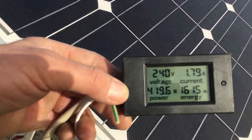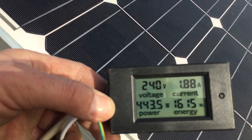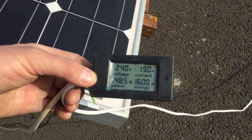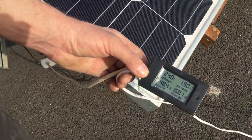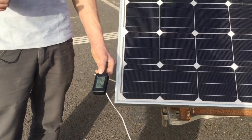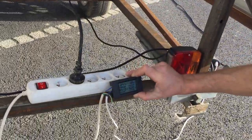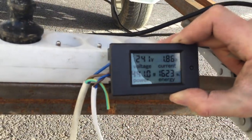If we had a large inverter instead, it would be catastrophic — we could drop from 500 to 100 watts. So here it's 448 watts, but it's not the panels consuming 448 watts — it's that we are injecting 448 watts into the grid. So we don't buy that electricity — it's free. In fact, the electricity is free: here it's 441 watts from the solar panel.